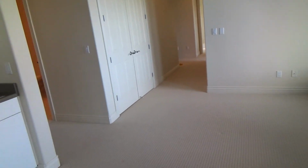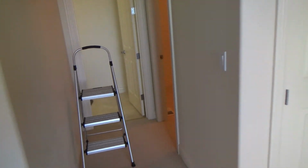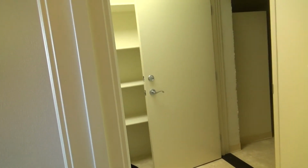All these bottom doors, I will have touched every single door down here except one door, and that door was in here. That door's working fine. That's a metal door, by the way, but I could have adjusted that had I needed to, but we already talked about that door in certain videos. But I've touched every other door. I'll touch these double doors and that other door, making sure the hinge screws were tight, and the ones that were loose, we tightened with longer screws and got them in there.